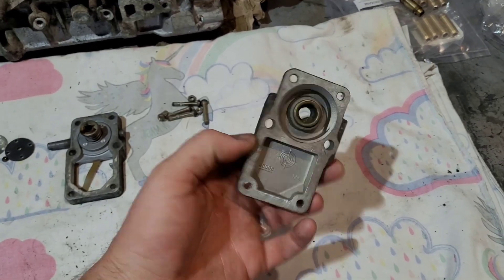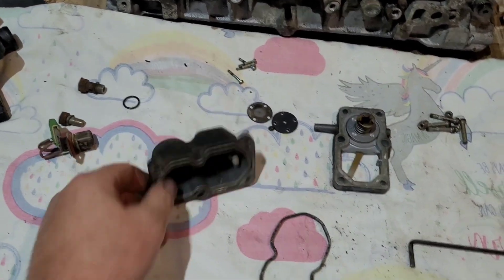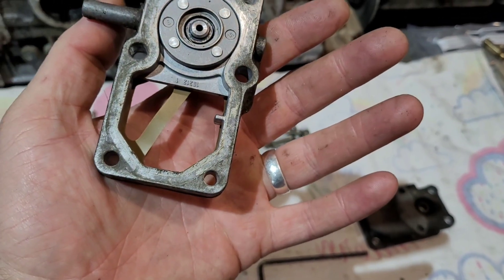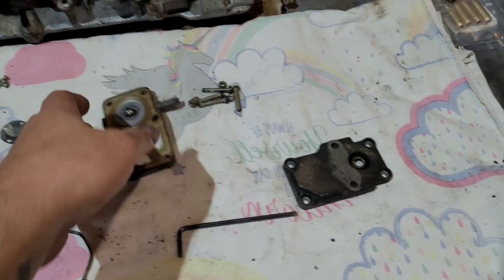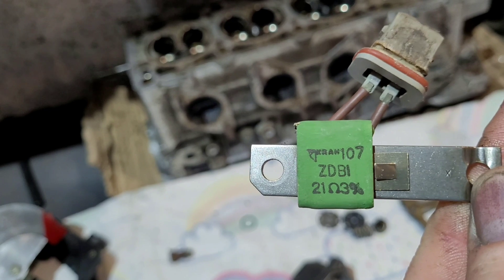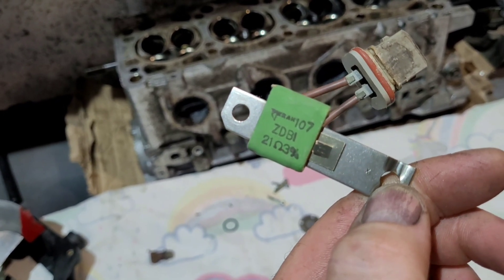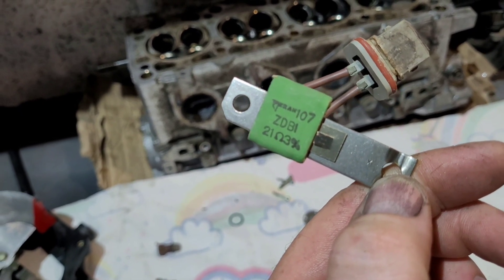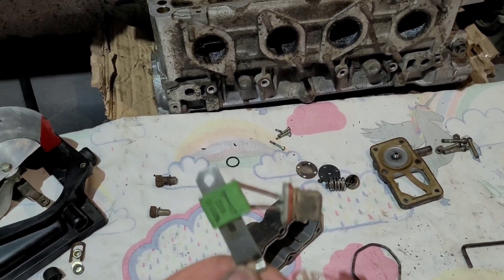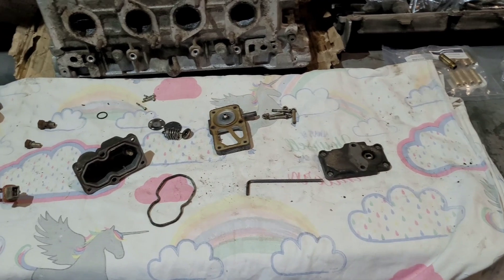That is the physical modification. Once you've done that and you're happy there's no swarf inside, rebuild the meter head as you would with a new kit. You mainly want one seal — an O-ring that sits inside there. If the gasket is fine, there's no need to change it, but depending on what kit you buy you can change all of it. A simple way of testing the heating element: the resistance across those two pins should be 21 ohms plus or minus three percent. I've never found one that is defective — it's normally stuck seals preventing fuel coming through.